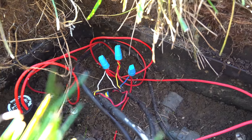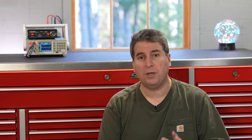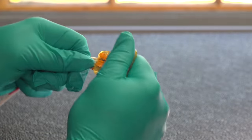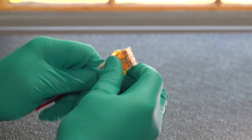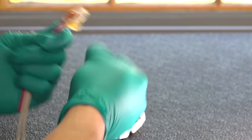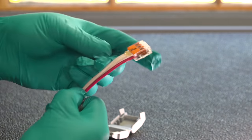If you've ever done any work on sprinklers, you know that there are solenoids and valves that regularly break and eventually need to be replaced. In the old days you used to use wire nuts filled with silicone. If you use these Wago 221s it can be very different — it's not just about the looks. The reason you want to use these is because just like regular Wago 221s, they are replaceable and repairable if you need to make changes to the circuit in the future. You're not gluing them together with epoxy — you can simply open the connector up, remove the Wago 221, and still save your connections.